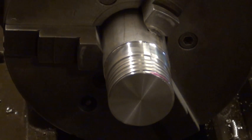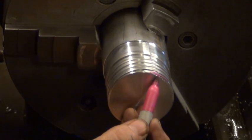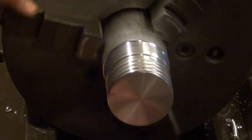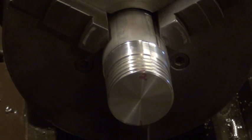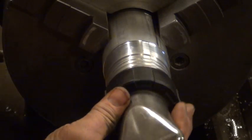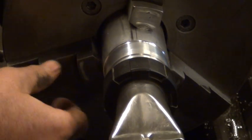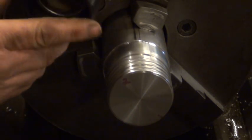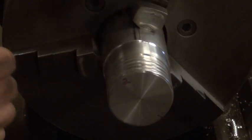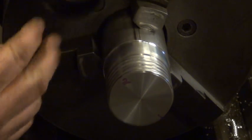I need to take a little bit off the overall diameter, cut the threads to get the fit. One start there. The lighting's not working real well. Now it's a case of seeing what the nut size is on his grinder, how much smaller it is. I may just bore this out, cut internal threads, and keep it short enough to fit right inside this. Or I may cut it off a little longer so I can do a taper inside off his grinder to open up bigger into this side.